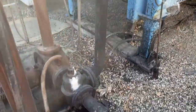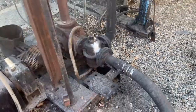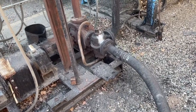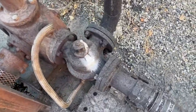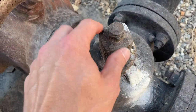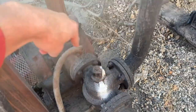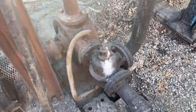The first valve is right here. This is a 3-way valve. 3-way valves are a little tricky because it can be a little hard to know which way you're turning it so that the oil goes the right direction. So I'm unloading right now. It's got paint on here, but in case this paint wears off, there are these 2 notches, okay? These are the raised parts, and it's going into the pump with the hose. So that's how you need to turn that valve.